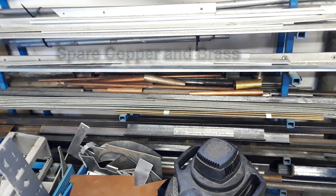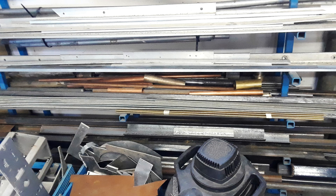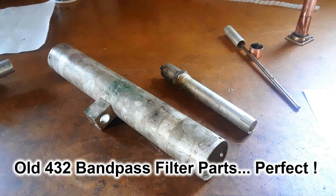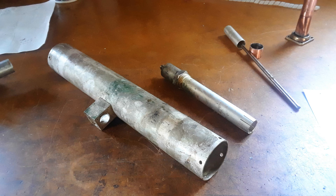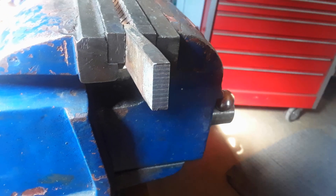The part I needed to start with to build the waveguide itself was a piece of tubing 22 millimeters in diameter. I had lots of copper pipe like that but none on hand, however I do have some scrap pieces from old UHF 432 duplexers — the inner tuning adjustment pipe is perfect, exactly the right size. I cut the pipe to a random length just to get the slots off the end and a big knurly nut off the other end to give me a straight piece of pipe. The next trick was to squeeze the end so it would go from round to a rectangular shape to fit the WR90 waveguide fitting.